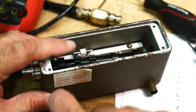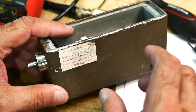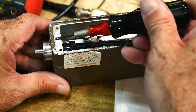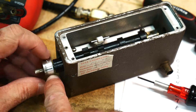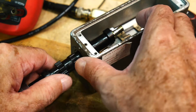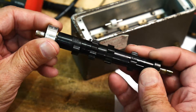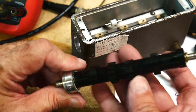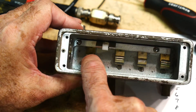Okay, here I'm taking it apart. I told you last time that I thought this hole here didn't seem like it should be there, but it actually should be. It holds in this cam mechanism. There's a set screw here and a set screw through here, and that holds this bushing in, which holds the whole cam mechanism. This piece here has a bushing — just a bushing.